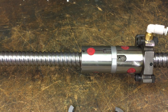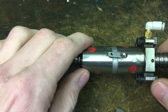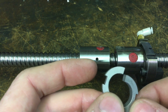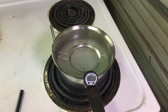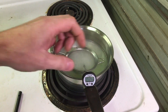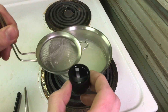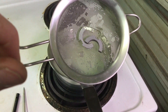I was thinking I might try to make some new ones that go in here and bridge the gap, but I'm still undecided on that — might do it, might not. What I know I'm gonna do right now is go Parkerize these. If you know anything about me by now, you know I'm sort of a tinkerer. My temperature is coming up — I'm about at 190°F. I normally shoot for 170-180°F, but I think I'll be fine. Got my two parts in some brake cleaner to keep them degreased — that's important.